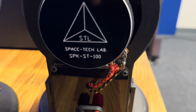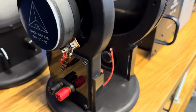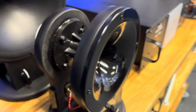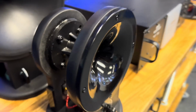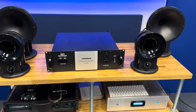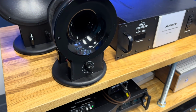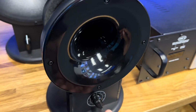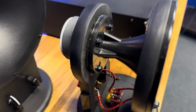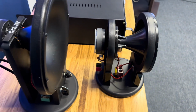And when Al does these horns, he has to match them with whatever gear it is that you're using. And you remember on the Shinjitsu horn, it's 1300 hertz, more of a specific application I was trying to do. Bob and I did take these horns and try them on the Heresy regardless before we even got the Shinjitsu horn. And it was kind of redundant. It just didn't make sense, and the Shinjitsu had to be used to just do a completely different frequency range.